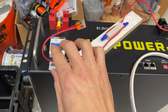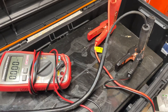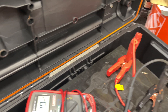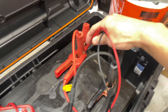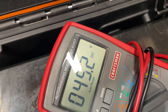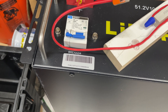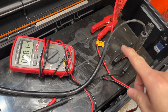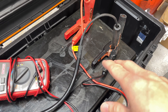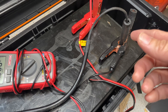Since that's going, let's see what happens if I turn the jump battery off. Now we've actually got 54 volts — or 45 volts — being applied to the battery by the charger, while this EG4 LiFePower4 battery is off. That means this battery is now being charged by the charger, as you can see it's blinking red. Maybe the battery died because it just ran completely dead and entered protect mode. I'm going to try to log into the app to see if it's connected or charging.